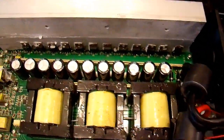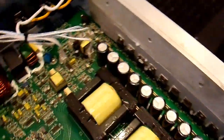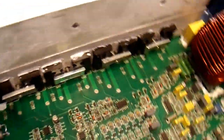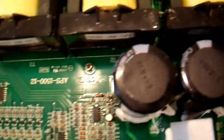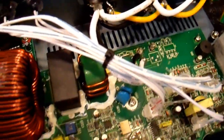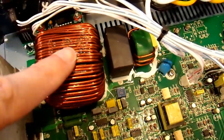While going through this inverter, taking it apart and ohming out all of these transistors to make sure they were okay, I was getting puzzled because pretty much everything inside here looks alright in terms of function — it certainly doesn't look alright, but that's beside the point. I couldn't find anything wrong, and then I picked it up to turn it around one more time and noticed something.